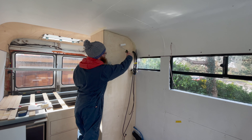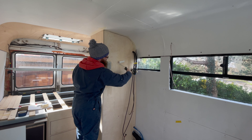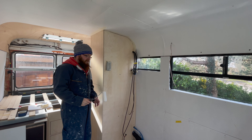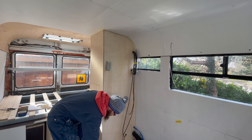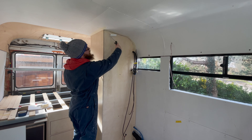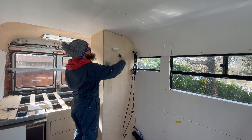We're going to start from the power source forward. I'm not going to hook up the power source yet, but this will be attached to your fuse box. The middle connector is going to be from the power from your battery — that will attach in here. You can see I've just put a spade terminal on here. Using a WAGO nut, I'm just going to pop that on the black. Then you're going to pop the blue on the top and the brown on the bottom. And then this black is going to go in here.